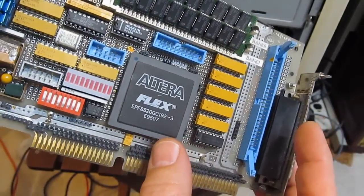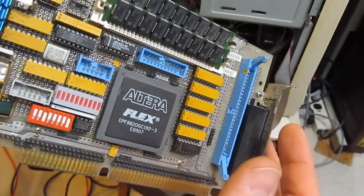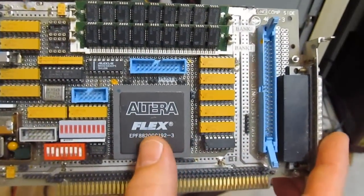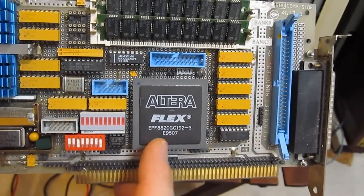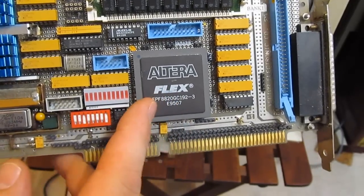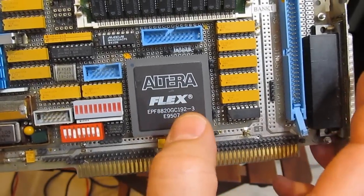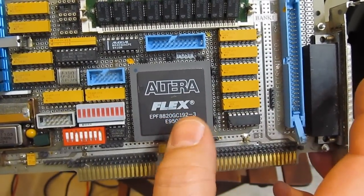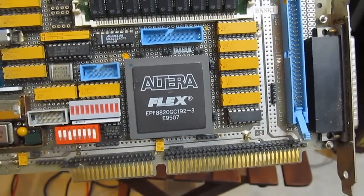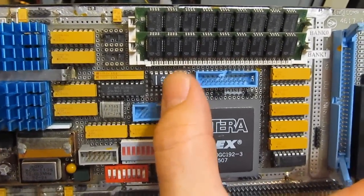At the time I was doing the work with Altera, they had something called their Magnum license. Costs for these tools were about $6,000, though occasionally they'd run a discount deal and you could pick up the tools for about $2,000. They had a dongle that would plug into the parallel port. So what I did is I reverse engineered the dongle and implemented it inside of this FPGA. This FPGA also has the postcode diagnostics and a synthesizer for the clock. You can see up here this is a 232 transceiver.